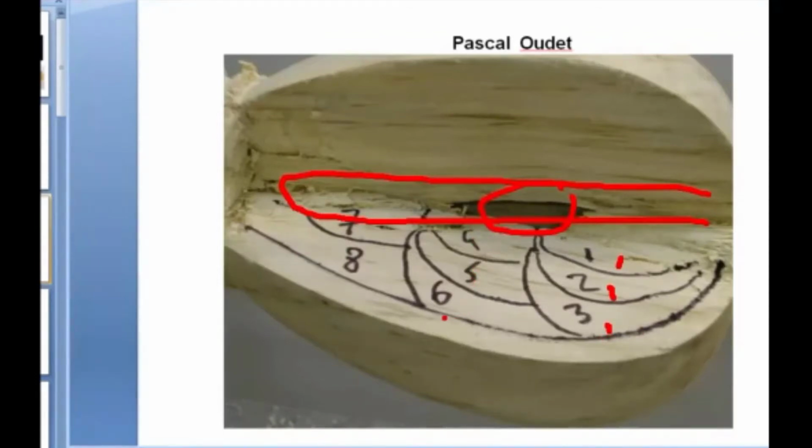And the idea here is that, number one, you're leaving a lot of wood down on the bottom so that the piece is very sturdy and not flimsy and not vibrating. And the second thing is, especially if you're turning green wood, which is much, much easier to hollow than dry wood, you're able to get fully smooth, uniform walls before the piece starts to warp.